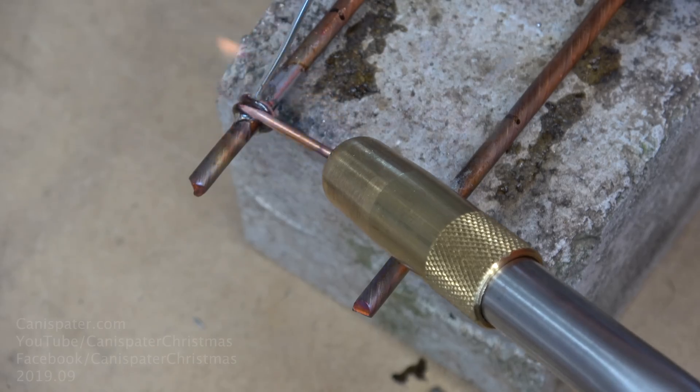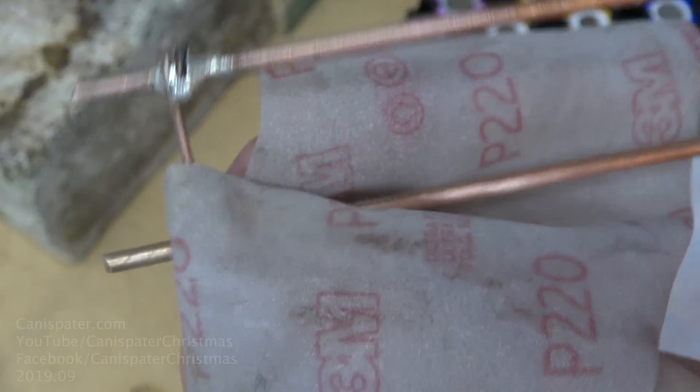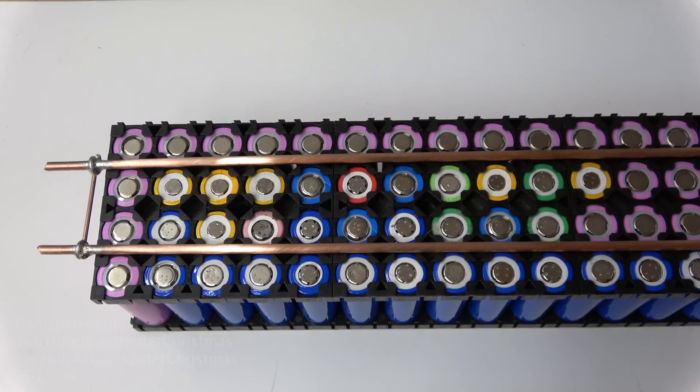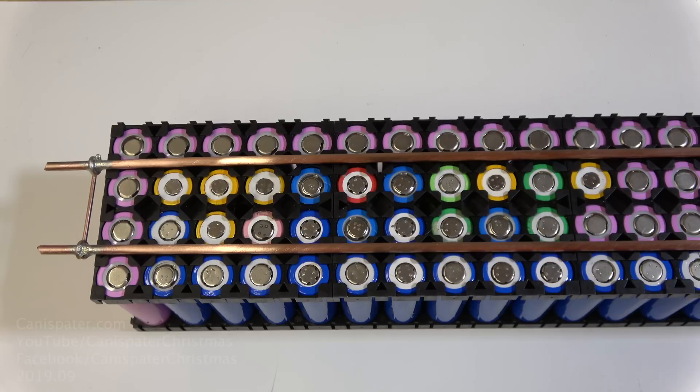Plus I got to use my torch. Once it cooled down, I took some 220 grit sandpaper and just removed the oxidation from the bus bar and cleaned up the solder joint. Here it is all cleaned up — from now on I will not touch the bar with my bare hands; I don't want to get any oils on it. I'm hoping that'll make it a little bit easier to solder. The crossbar hangs off just a little bit, but that's okay. Here are two bus bars for one cell pack. I'm going to put connectors on the end of them before attaching them to the pack — it's a little easier than trying to do that after the fact.